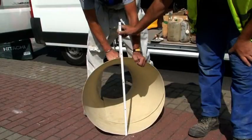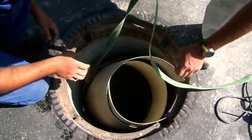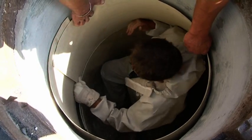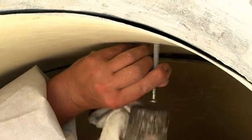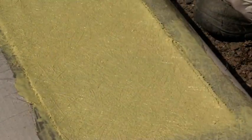The inlet and outlet connections are fitted. A flexible GRP taper element is used to line the taper; it is aligned and then fastened with anchor bolts. All joints and edges are sealed with GRP laminate.